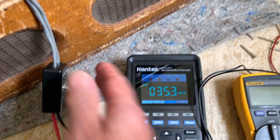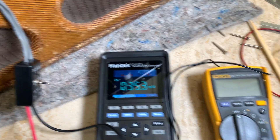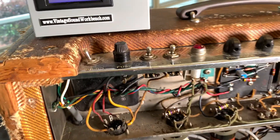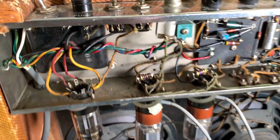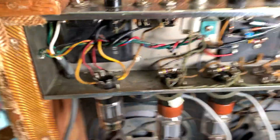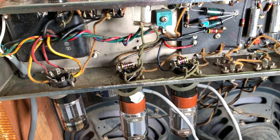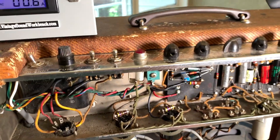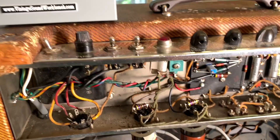One of them is probably on the hot side, so I may have to turn it down a little. If you're playing your amp and you notice it's not sounding quite as good as it used to, it could be your bias. If they get too cold, they get this weird kind of nasty distortion. They say to adjust these by ear, but that's not so easy — you've got to adjust it, then play it, adjust it, play it.